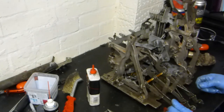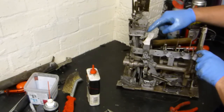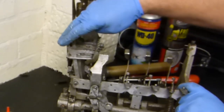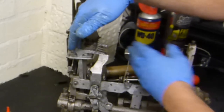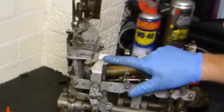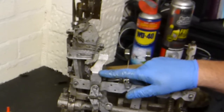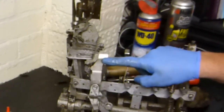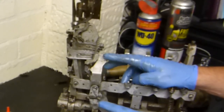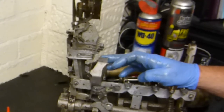We now need to put on the reel bundle. One thing I haven't put on over here are the springs — the upper springs for the vertical payout fingers. The reason I haven't put those on is because if I do, they'll be pushed forward and sometimes get in the way of putting the reel bundle in, so I'm going to leave the springs off so they're easy to push back. This lever here stops the reels from spinning backwards when you first kick the reels round at the start of play, so that needs to be out of the way. On this particular one there's a little moveable lever, so I'm just going to move that out of the way.